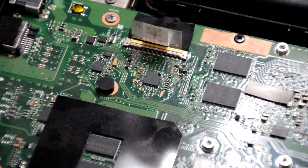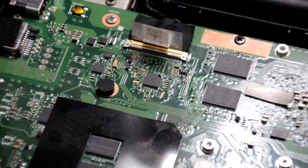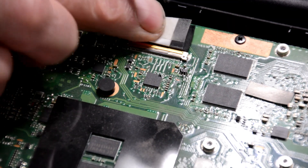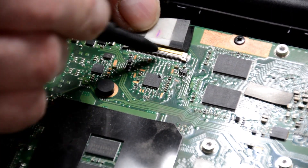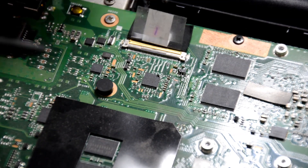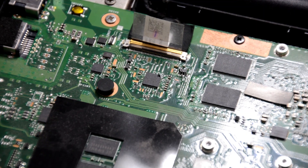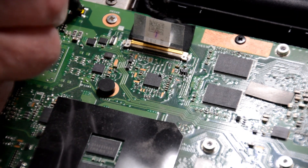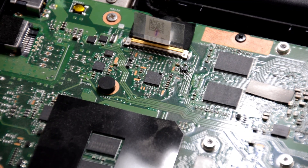Now we have the top removed off the laptop; the keyboard comes off with the housing. The main area I'm concerned about is this data cable here, the connector — make sure it's all okay. There are two voltage points here we can check, and we'll just power this thing up. She's firing up and she's got no display.